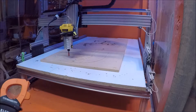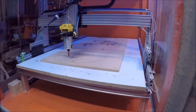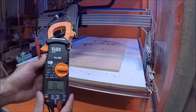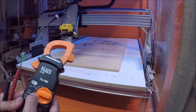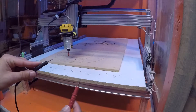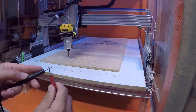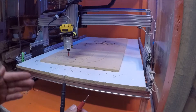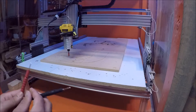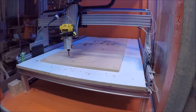Let's look at base conditions right now. My thought is that none of this aluminum extrusion on the CNC machine is connected to the ground terminal inside my control panel — I'm pretty much positive it's not, but we should test anyway. This is a multimeter, and it has a continuity function — basically, if the two probes register zero resistance between them, it'll make a chime sound, telling you there's zero resistance between the two pieces you're touching. I'm going to put one probe on my ground terminal inside the control panel and the other on random points on the aluminum extrusion to see if it chimes. I really don't think it will, but let's give it a shot.